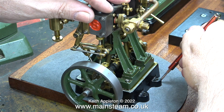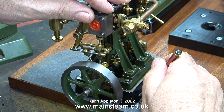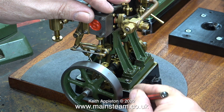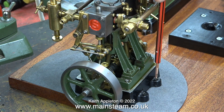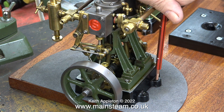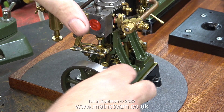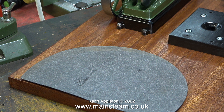The next part of the job is very simple. Using my specially modified pencil, I'm just drawing around the gasket. Why is this pencil modified? So it can become a deep hole marker like this. Making the end of a pencil much smaller on my one-inch belt sander makes a tool that is much better than the felt tip pen type of deep hole marker, because the original diameter of the pencil is much less than the felt tip pen.